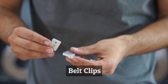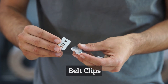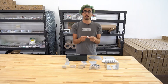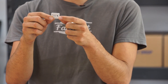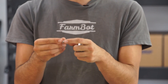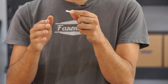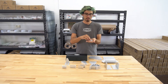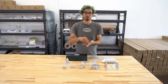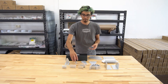These six components are called belt clips and they are used to secure the ends of the GT2 timing belts to the track extrusions and the ends of the gantry main beam. They have a single M5 hole for mounting to the extrusions and a few slots that you have to route the belt through in a specific way so that it can tighten and be held securely. There are six of these — two for each side of the track and two for the y-axis belt along the gantry main beam.